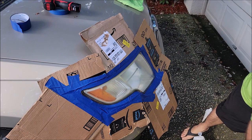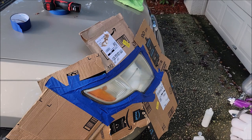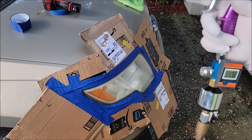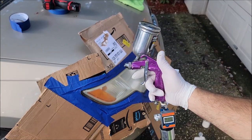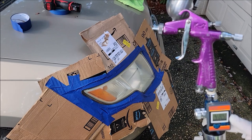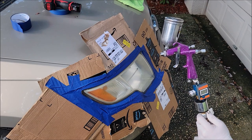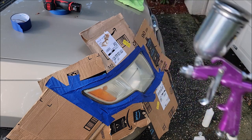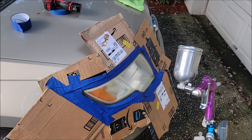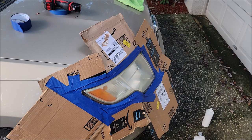Now it is time. Again, if you're not in a well-ventilated area, I highly recommend a respirator and always wear your gloves. I do have a filter and a dryer here, and I've also got one at the compressor. I am using the Porter Cable six-gallon pancake compressor for this. This is the Harbor Freight gun. I'm going to run this at a little less — we've got about 43, I'm going to run it at 40 PSI. There you go, it's right about 40. I've already got the coating inside here. So here it goes.